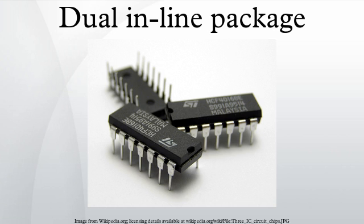The first devices had 14 pins and looked much like they do today. The rectangular shape allowed integrated circuits to be packaged more densely than previous round packages. The package was well suited to automated assembly equipment. A printed circuit board could be populated with scores or hundreds of ICs, then all the components on the circuit board could be soldered at one time on a wave soldering machine and passed on to automated testing machines, with very little human labor required.